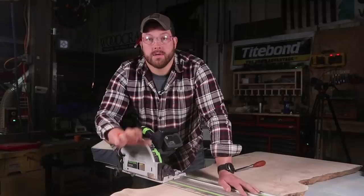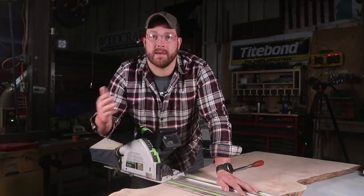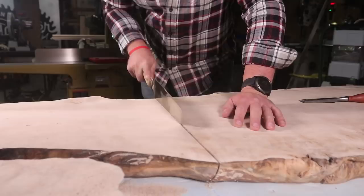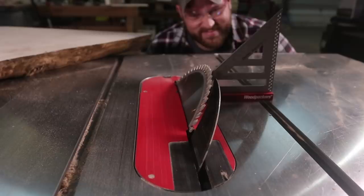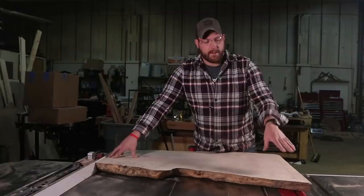I want the whole table to be 19 inches high. So what I've done is measured 19 inches from our previous cut, made another line that's parallel, and I'm going to cut this in half. I'll do the miters on the table saw because after this there'll be more manageable pieces and it gives me a much more crisp miter. Because my table saw is big enough to handle the 40 inches I'm looking for on the top, I'm going to cut this on there. It also has a better depth capacity and there won't be as much deflection in the blade. I'm going to cut the opposite side to the part we just did and take slow increments — probably half an inch at a time.